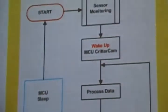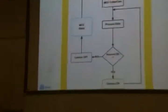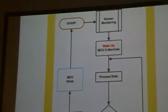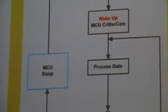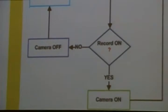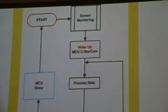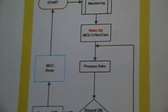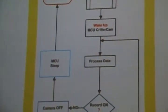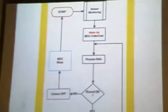What you see here is our flowchart, or the logic control of the system. It's very simple. Basically, the system sleeps while waiting for a signal of interest on the accelerometer. When it gets the signal, it's passed to the central processor on the parent unit, the CRITICAM controller. That unit makes a decision to turn the camera on or off. It may also pull in other information, like polling to find nearby CRITICAMs or checking GPS location. As long as the camera is on, it keeps evaluating that decision in the loop, and when it decides to turn the camera off, it puts the system back to sleep.